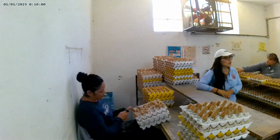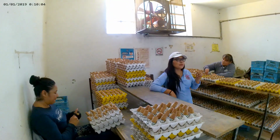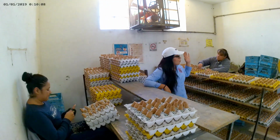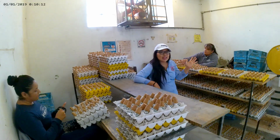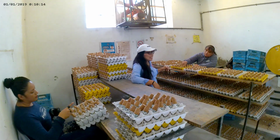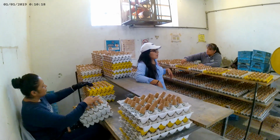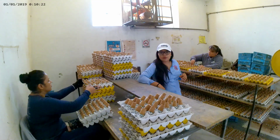These are natural corks that come from Portugal and Italy. We use a liquid glue that takes around one hour to dry out. Because it's a liquid glue, sometimes the cork tends to slide, and what we have to do is recenter them to try to save as many as possible. Once the glue has dried out, we're going to grab them and check for quality.